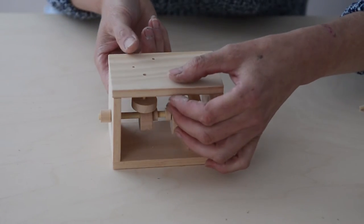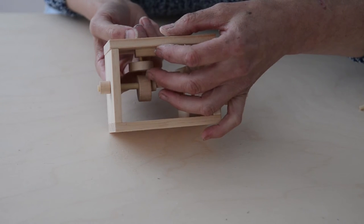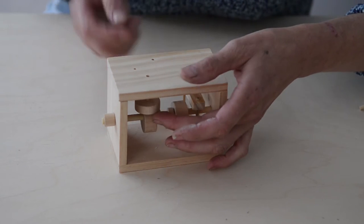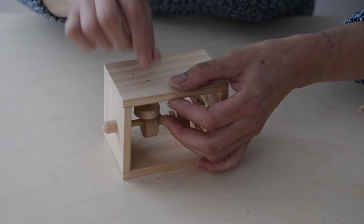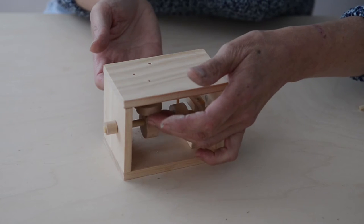In D4, you're going to be putting this cam follower with the peg in it underneath. It's very important that it is as loose and easy as that. If the hole down through there is a little bit tight, either sand the peg down till it's thinner, or if you have a small round file, file it out. And then wax the peg — it must just drop down freely.